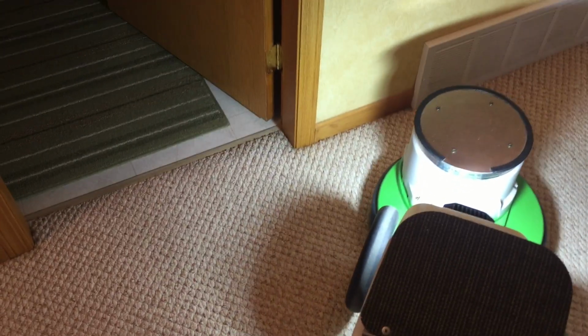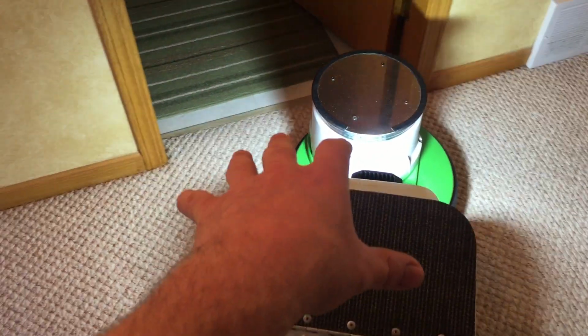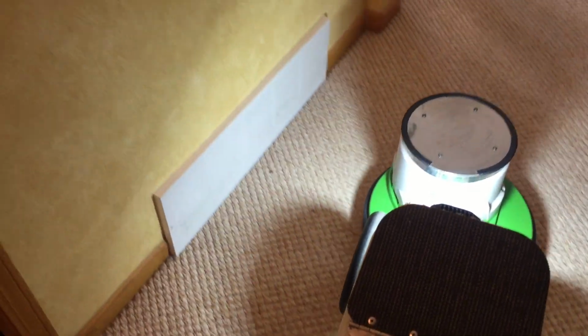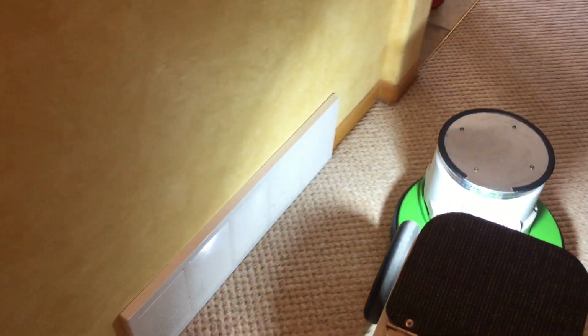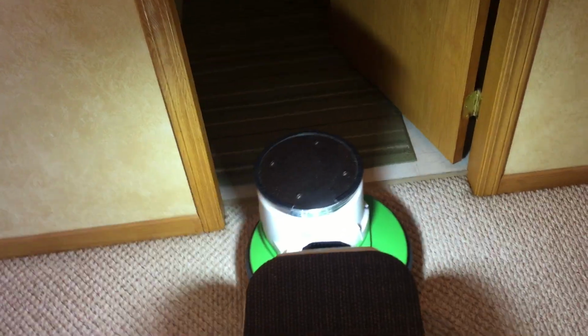I'm hanging up on the couch here. Get on top of this stairwell here again, and there was a pathway right here which was much more obvious before, which is now virtually gone. Just a little bit of wear that's appearing there. And one of the things that happens is, because I've got this bright light on it, as it shines down on the carpet, if it's soil it'll look more obvious, but if it's just wear, it'll just disappear in the brightness of the floodlight. So that really tells me exactly what's happening. That's one of the reasons for the light. I can tell whether or not I'm actually dealing with soil or just a wear effect on the carpet. I can see that it's totally disappeared, the darker appearance, because that's just wear.